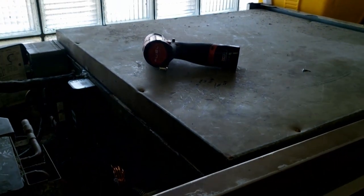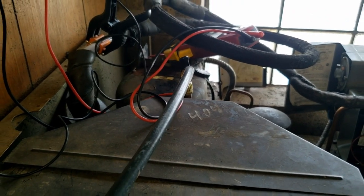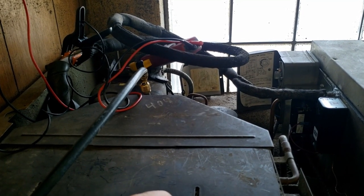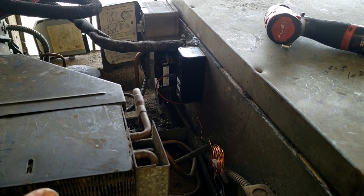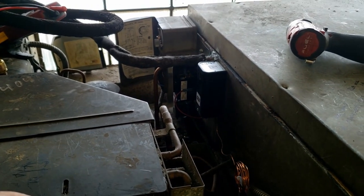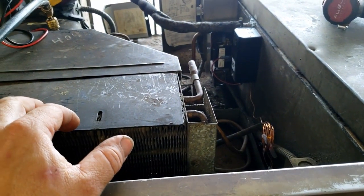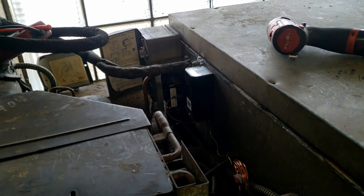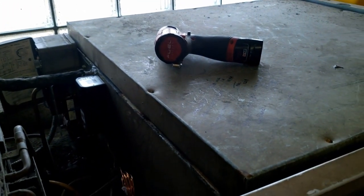I'm thinking we should go ahead and replace that fan defrost termination time-delay switch. It makes sense because the compressor does pretty good until startup. I'd like to maybe see a CPR valve on it, but it hasn't had one ever — so why does it need it now? I had the defrost set at 20 minutes, four times per 24-hour period. I'm going to take it back to about 27-28 minutes. Usually it's in the early 20s and it usually hasn't fully melted. There's not a lot of infiltration from heat back here. The thermostat now is only pulling less than 0.2 amps.